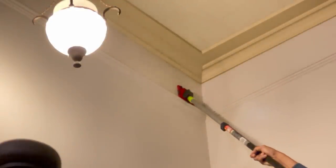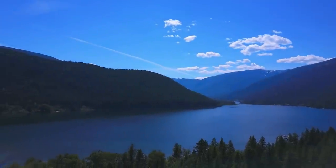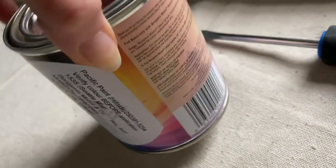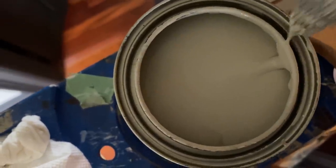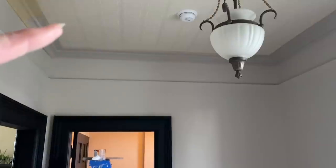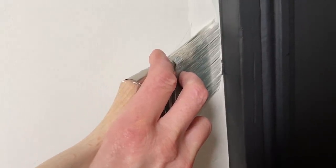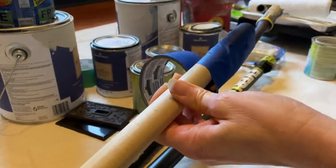It was just a fabulous tool to use in those hard-to-reach areas. Because I did not want to paint the ceiling — it's already an off-white that's not a yellow-cream white — to marry that Edge Comb Grey wall paint up to the crown molding I'm going to use a different, darker grey tone for the two-part crown molding. That way the ceiling and the wall paint kind of marry together a little nicer, and I can eliminate how much ceiling painting I have to do while still accomplishing the look I want.